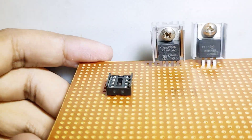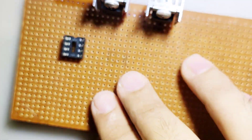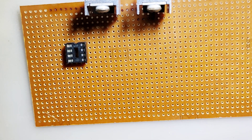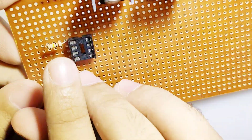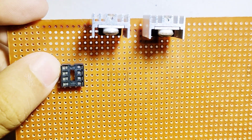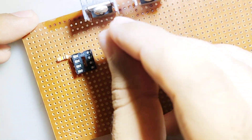You must use the correct inductor value to get the circuit working. I used a 100 microhenry inductor rated for 10 amps. The power resistor should be 0.1 ohms, and I recommend using a 5 watt resistor. To achieve maximum efficiency, use a good heatsink to keep the MOSFET cool so it can work more efficiently.